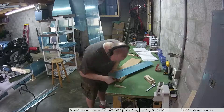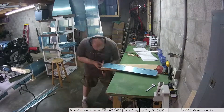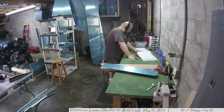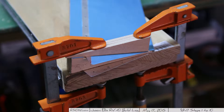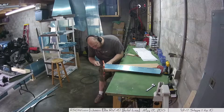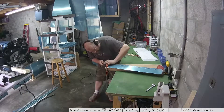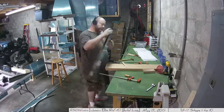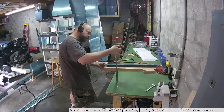Before you put the trim tab horns on, you have to bend either end on the outsides down. I'm clamping it up to get ready to do that. I'm using those internal inserts from the wooden V's — one inside and one outside to keep it square. You can see those tabs are what I'm going to bend, and I'm using just a simple tack hammer, going ever so slowly and bending it.